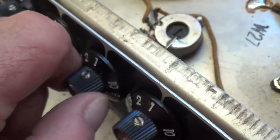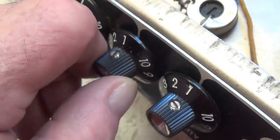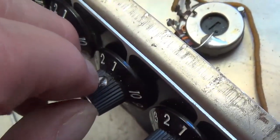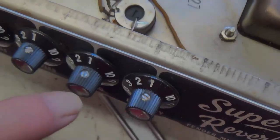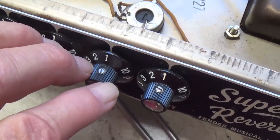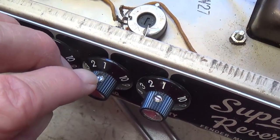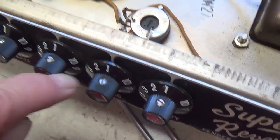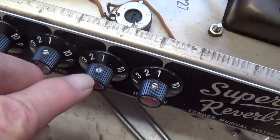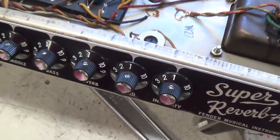And another problem came to light, and that is that this set screw is stripped. I don't know if it was that way from the factory or some overzealous screwdriver wielder happened to over torque it. But now I have to fix this set screw. Well, I suspected, since these are brand new knobs, that they're probably made in China, and that the set screw may be metric. So I tapped it for an SAE 8-32 thread, then used one of the set screws that I had on hand, and sure enough, it holds real tight, and I polished the end of it a bit so that it sort of can hold its own with the chrome-plated screws, but I thought that was a real serviceable repair.